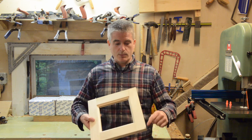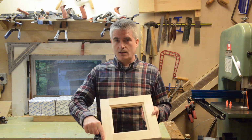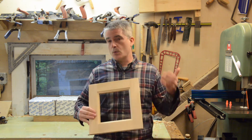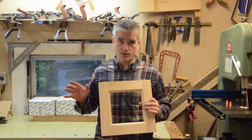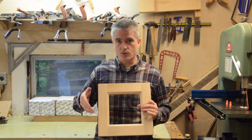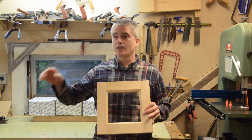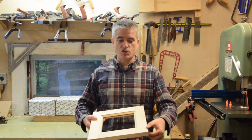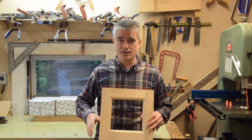Also, we haven't spoken about machining the outside of the doors. A lot of doors today, you'll see a profile on the front on the outside, or the back on the outside, or sometimes both. I've spoken with Whitehill about this, and tooling can be had that works perfectly with the zero set principle of the main tooling set. What that means is you can machine all the components as you normally would, assemble them, and then install a cutter block on the shaper, and you won't have to adjust the spindle height, you won't have to adjust the fence settings, and you can machine the profile on the outside of the door. That not only speeds up the operation, but really helps with consistency.